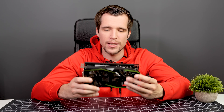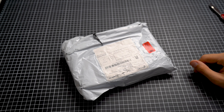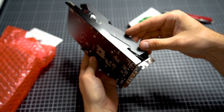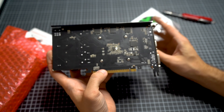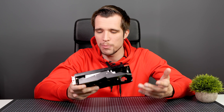I ordered this one from Wish.com and it arrived after about four to five weeks. But after like five seconds of holding it in my hands, I was like, this thing is not real. The graphics card was actually working and it was recognized in GPU-Z as a GTX 1060 with a lot of fake specifications, because they have a fake BIOS on the card. If you look at it, there are so many components that are missing. The cooler is the worst piece of crap I've ever had in my hands. This is really pure junk.